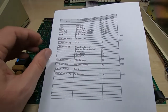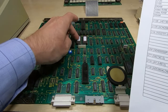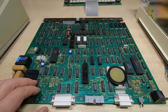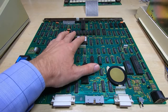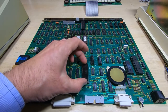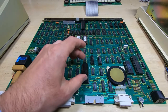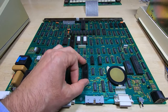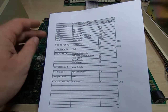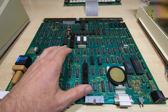I'll put the information onto my website and anyone that wants to get involved, please do. The idea is to reverse engineer the code in these two ROMs so it'll make it far easier to repair these machines in the future. The approach I've decided to take with this is to start with the fundamentals: we'll see if the Z80 is running at all, and if it is, I'll plug the Fluke 9010A into it and do some fault-finding using that, now that we have the memory map and know how to switch banks.